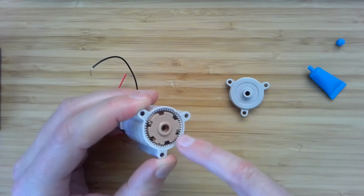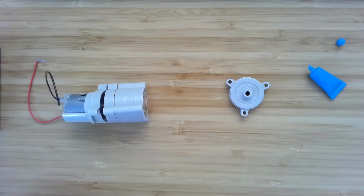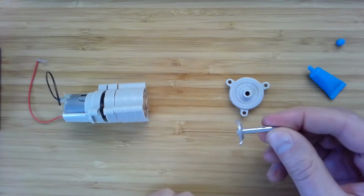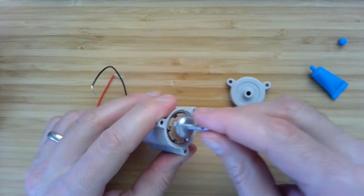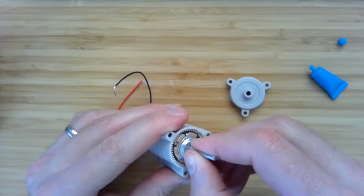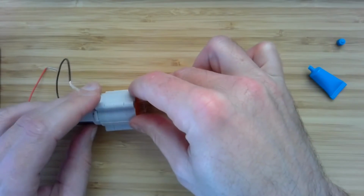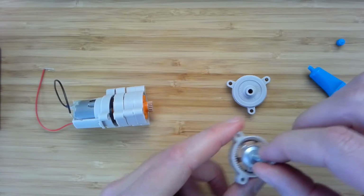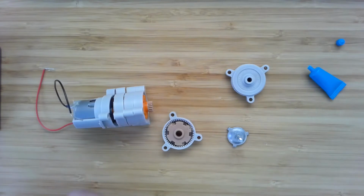And you see these notches here. Those will connect to the positive tabs in this output shaft. So it'll look something like this inside the gearbox, so that the gearbox shaft rotates with the cage of that last stage. Now, before we can connect this in, though, we need to put in this bit of housing.